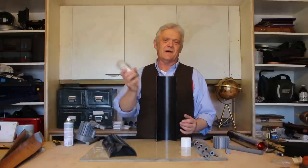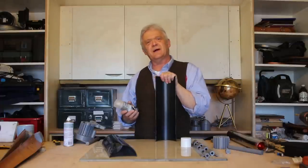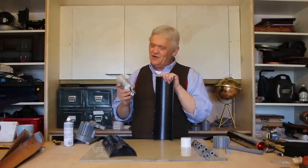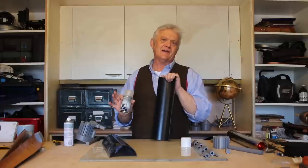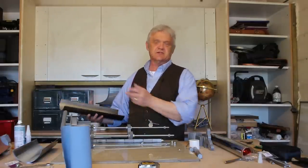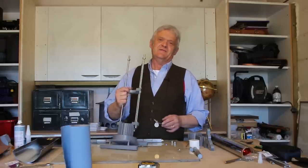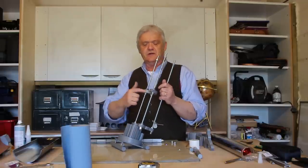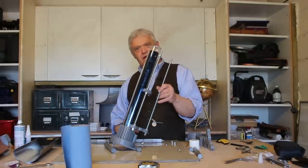I want to show you this stuff — I'm not being paid to do this, I bought it myself. It's a Rustoleum paint product called mirror effect. Mirror paints have been very disappointing in the past but this stuff is astonishing — how easy and well it forms a mirror. I'm going to spray paint the inside of these with mirror effect to create curved mirrors. You could probably get a similar effect with aluminium foil but it does give a really nice mirror finish. Into the base unit I've put three 43-centimetre eight-millimetre bars, bolted down with a cap nut and a nut, plus a central spacer — the tube just goes in there and rests.